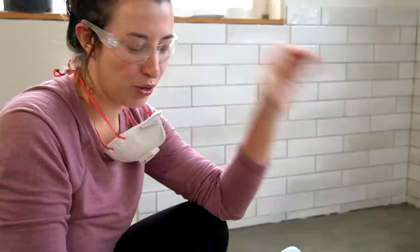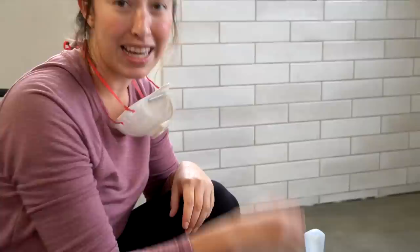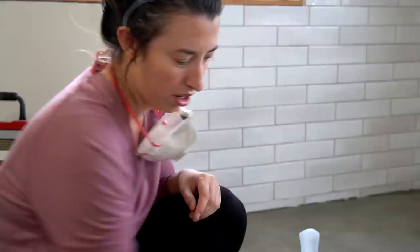Normally you wouldn't want to do that if you were going for a beautiful smooth concrete slab finish, but we know that we can't get that. So what we're going to have happen is called the salt and pepper look, but it's intentional. We have some of the exposed aggregate, so little particles in the concrete itself. That's just because we had to get rid of the fine powdery layer on top, which was from me troweling. When you do that, it brings some of the finer particles in the concrete to the top layer. Let's work on the corners and then we're going to do some sanding with the orbital sander.